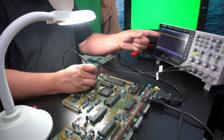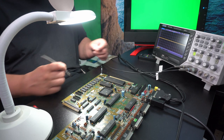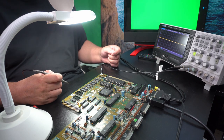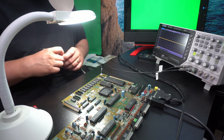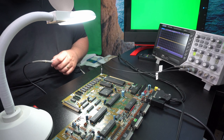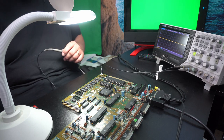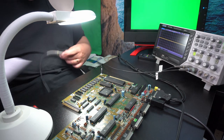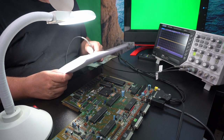Yep, trigger. Now this is a computer from 1988 with one megabyte of RAM, so give it time, because it's amazingly slow compared to modern CPU equipment. Like you saw, I had to wait. When this is cycling, I think it's doing a memory test to get this result. I think it's actually trying to populate the memory, and then read it back. So write to memory and then read it back.